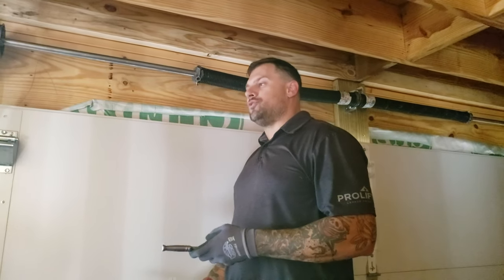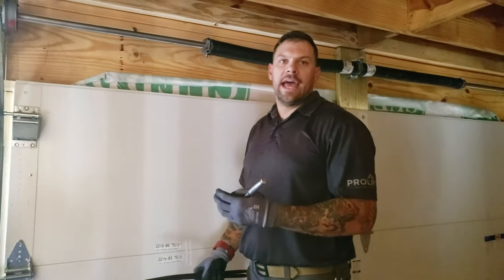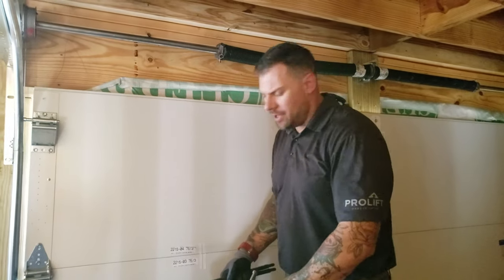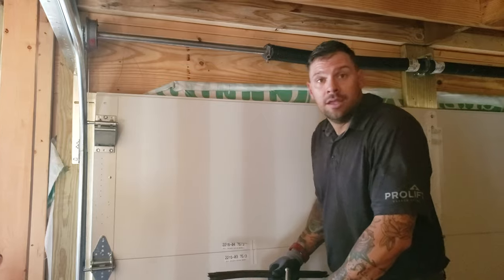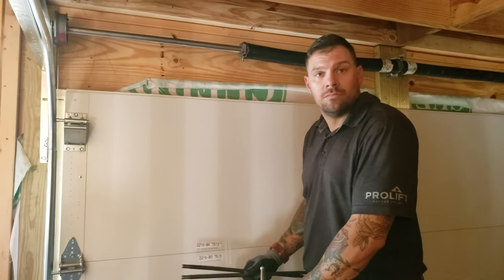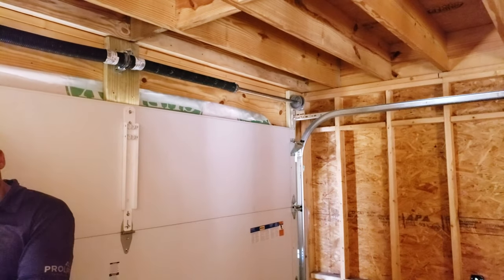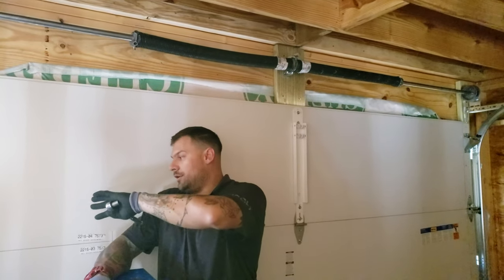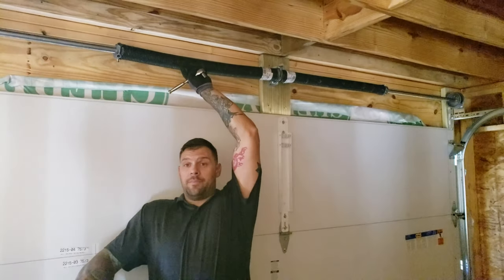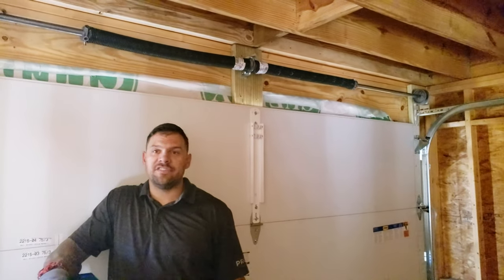What would you suggest? You want to use some sort of silicone penetrating gel — something that sprays on. I like the clear stuff. A lot of them sell at Home Depot or Lowe's and go on yellow. That's something a homeowner can do. They need to call you guys when it's not going up right. If you're watching this video, I would never adjust the springs myself. We do a $59 service where we come out, lubricate, and tune up your door. If you're having issues, we want to check your tension, springs, and motor. A lot of times the chain needs readjusted and lubricated. For $59 we come out and do a 21-point inspection and take care of everything.